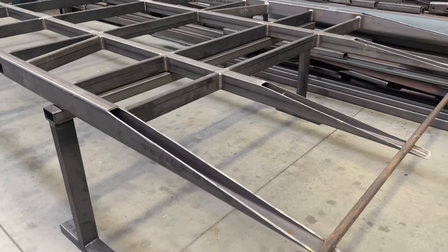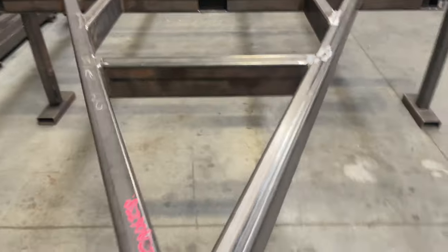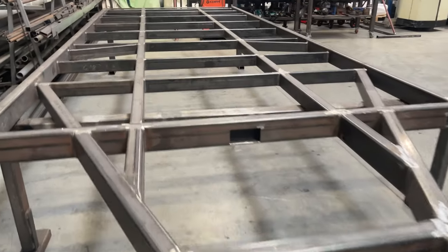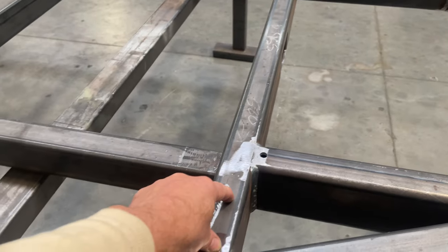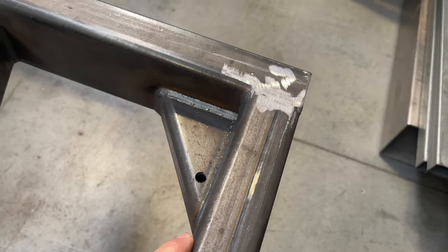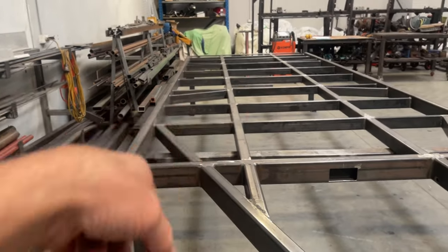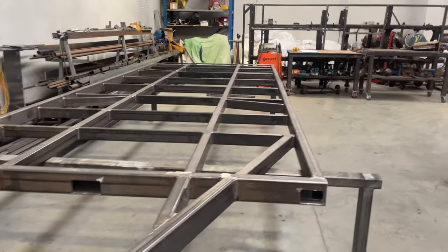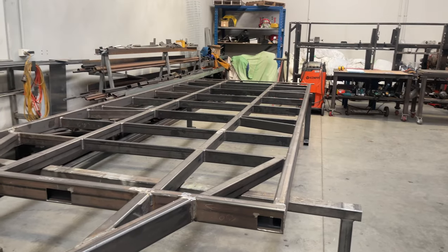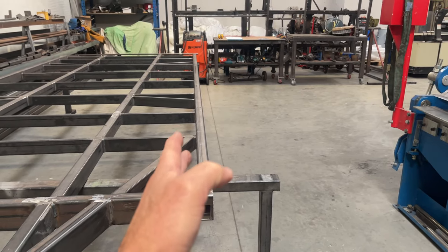The air and wiring simply come down to the back. The A-frame is made out of 100 by 50mm and it's 5mm — very thick. You're never going to bend it, break it, or have it tear off. Because of all this strength, and with these brackets on the back, it's not going to twist or tear, and these gussets in the corner make the thing particularly rigid and strong. Make sure you build it nice and straight and do those cross measurements regularly. You can put a truck strap on the corners and crank up the ratchet to pull it into alignment so that when you continue welding it doesn't pull — they will pull as you weld on one side of a piece of steel.